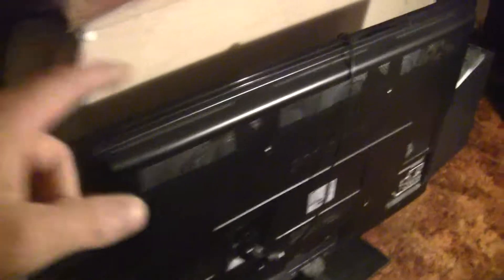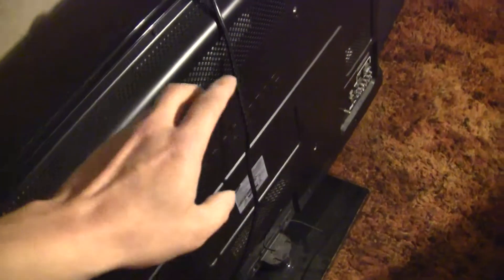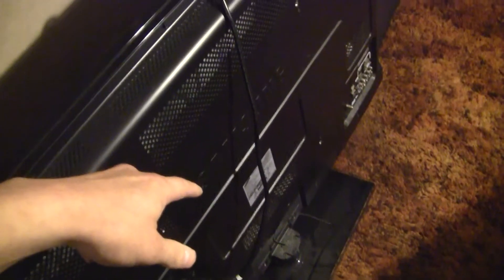I could take the back of this, basically take the screen off and mount it — it should be grounded too, I don't think it'd be an issue. I can even wire it so it'd be a single cord, I can even add fuses, metal oxide varistors, fault protection, and some additional filtering circuits. These have really broad VESA mounts, so there's room in between to mount the motherboard on, and I think I can take advantage of the airflow from the fans to help with cooling whatever system I put on there.